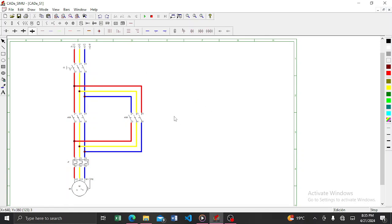Remember, this is our power circuit, and if I try to simulate this — that's good. The next thing we need is to add the control circuit. In order to add the control circuit, you just need one phase. You tap one phase using an MCB. So go to switches and select one MCB — switch one.